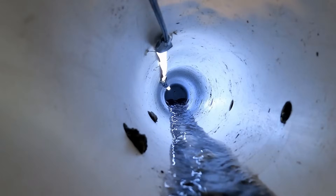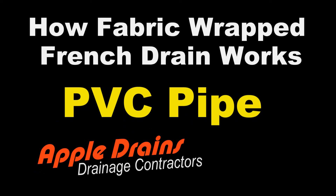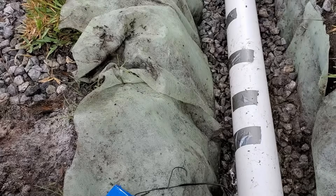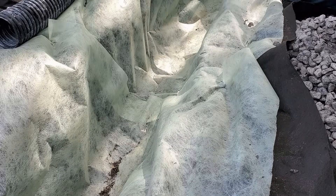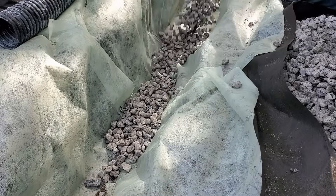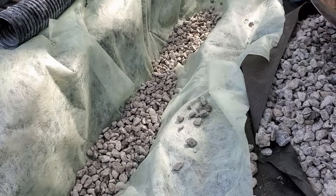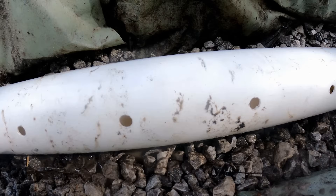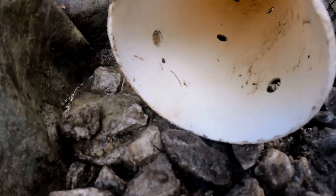Now let's build this PVC drain. A quick note: the duct tape on top of the PVC is there to hold the lights, allowing us to see inside the pipe. So we dig the trench, we lay the fabric across the trench and pin it so that it stays down nice and tight. The next thing we do is add a base of gravel — this is the most important part of this system. That base of gravel allows the water to flood up into the pipe and the pipe will carry it away.